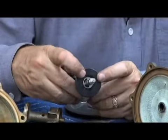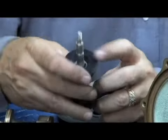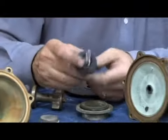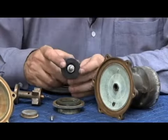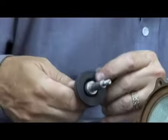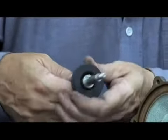The upper portion of the stem was held with an E-ring. You can see there on the top. Trouble was, remember that this goes in an up fashion to close. What happened after it closed several times is the E-ring would be pushed off of the stem and break it apart. So the next generation they tried, they had to make it more solid stop up there, and what they did is they took a small little piece of stainless and put a little clip in there and actually screwed that little stop ring on the top of the stem.